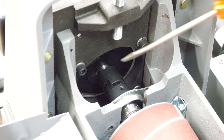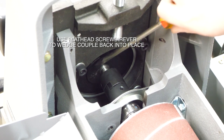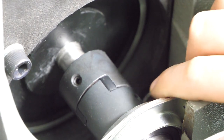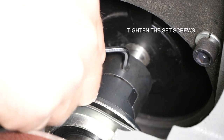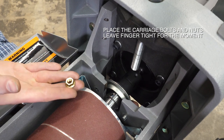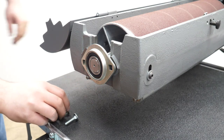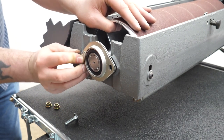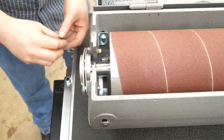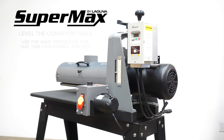Move the rear mounting bracket back into place, then put the screws in. Take the coupler and wedge it back into place with a screwdriver so you have the correct amount of gap. Tighten those set screws down. Then put the carriage bolts back in — finger-tighten the bolts and nuts first, then alternate back and forth on each one as you tighten them down.